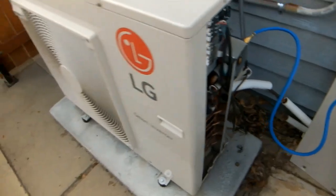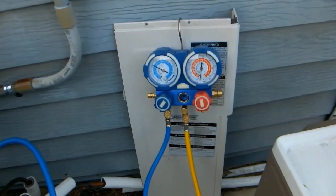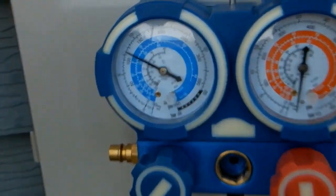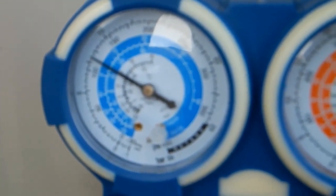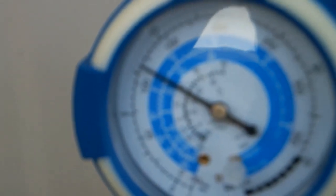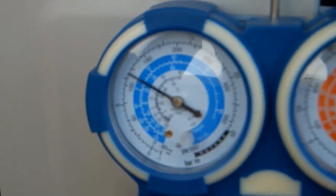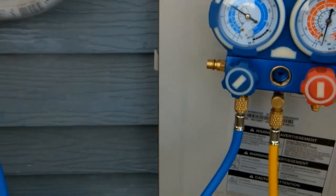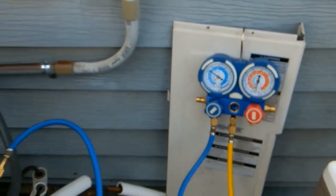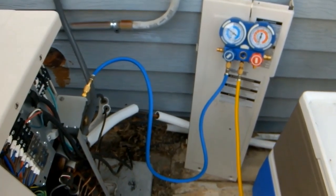I stepped inside the house and turned on both of the indoor units connected to this compressor. Each indoor unit is 18,000 BTU, meaning each is one and a half tons, and I've got them both running. They're putting out beautiful cold air — it feels wonderful. As you can see, the PSI of the compressor is running at about 119 to 120, which is ideal — straight out of the LG specs. LG specifies between 120 and 130 PSI. We're running really well with cold air going out. Thanks for watching.